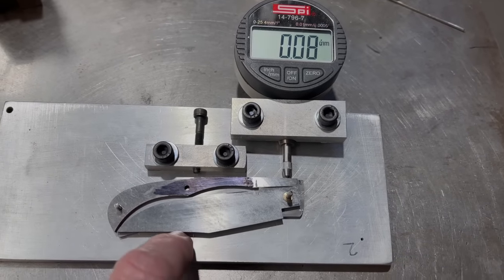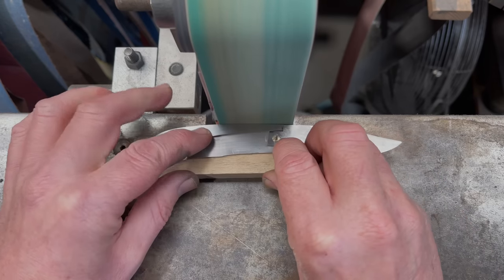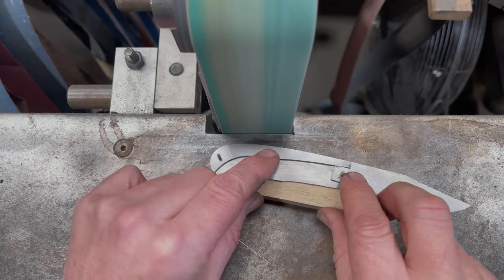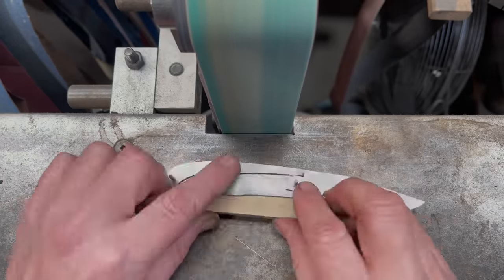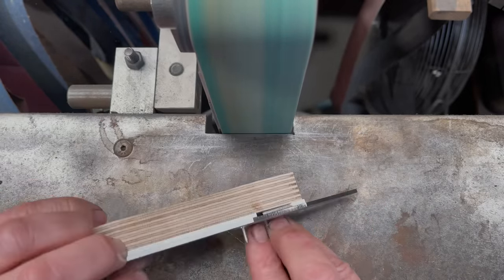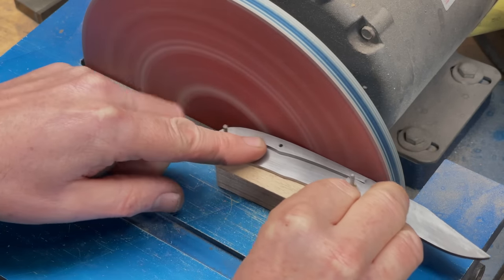When we did get them close, we ground the back of the knife, blending the spring, the liners, and the back of the blade together. I believe that the timing isn't essential. The blade will open fine without it, but what the timing does is ensure that the spring is flush with the back of the liners in the open, half stop, and close positions, and this will elevate the quality of the knife to another level.